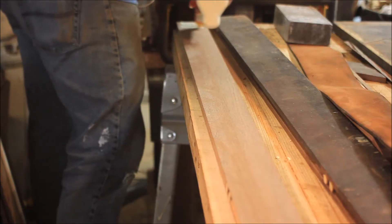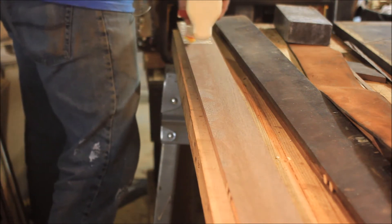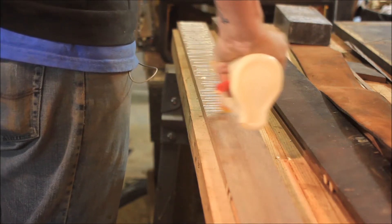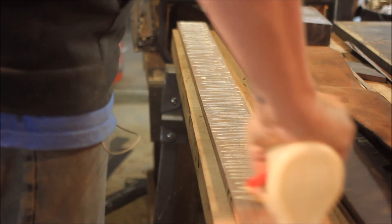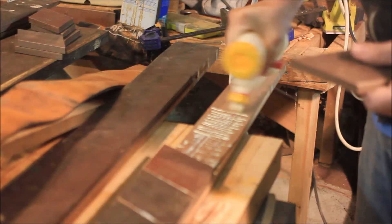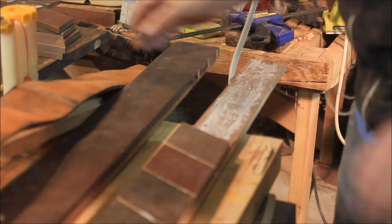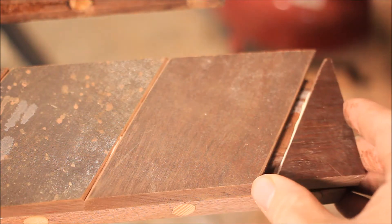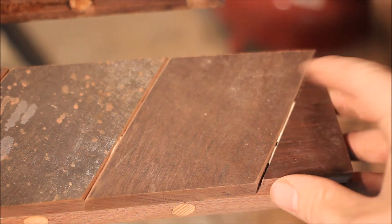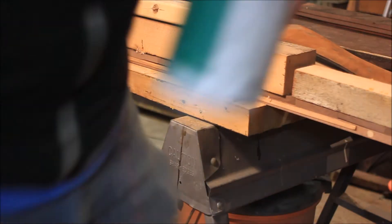The real challenge here is alignment, and at the end of the day I could have made a jig for it, but really doing it all by hand and making sure that I'm just as precise as possible suits me a little better personally. I'm building these in strips individually and then I'm going to laminate the leather piece to a board for the center of the inlay and glue it all up with the panels just like a regular tabletop glue-up. Because I'm using relative dimensioning instead of precise numbers, this made the most sense.